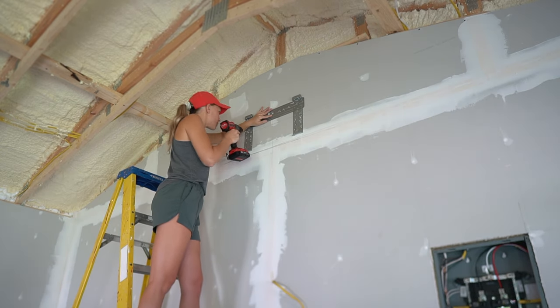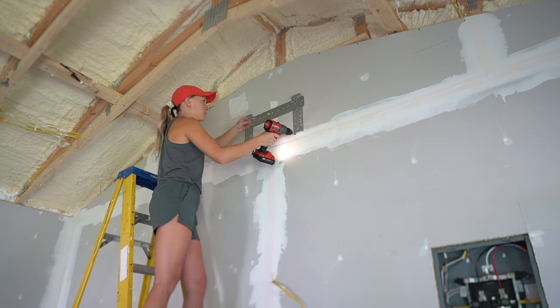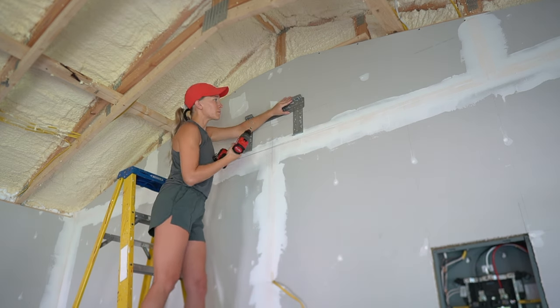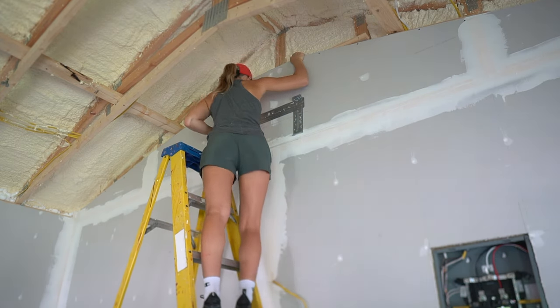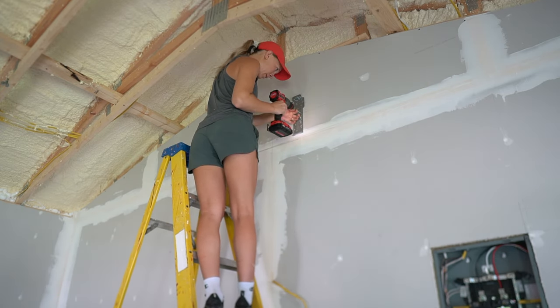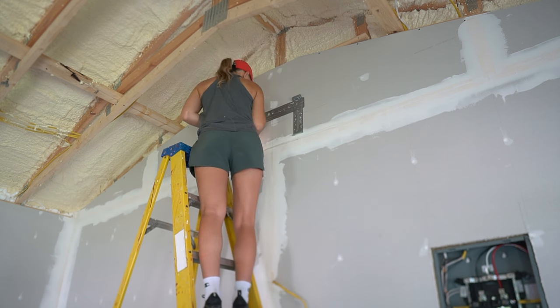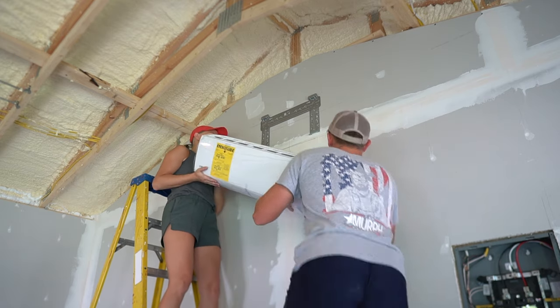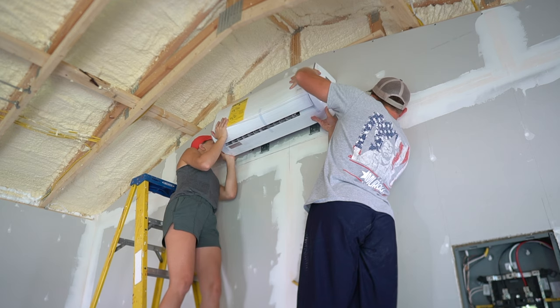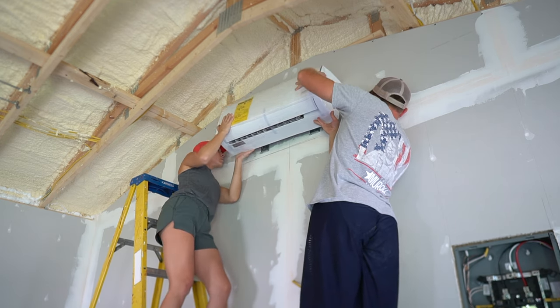With your mounting plate secured, the next step is drilling a hole for the connective piping. We're positioning the outdoor unit directly below the indoor unit, so we decided to drill the hole in the bottom right corner if you're looking at the front of the unit, which is one of the suggested locations. The piping can also exit from behind the unit on the left side. If you have something hindering either of these positions for the hole, you can drill a hole on the outside of the unit on the left or right side by removing the left/right plastic knockout panels.